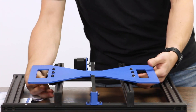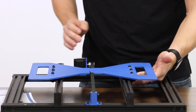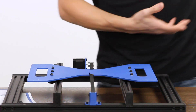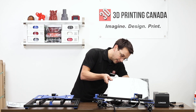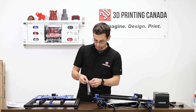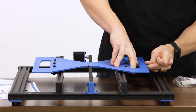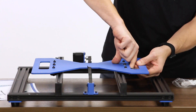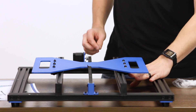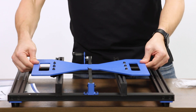So I'm just going to check the wheels on here. They're all contacting, so as I roll any one wheel the bed moves. This middle one has no tension, so I'm going to tighten that first. It's a good idea to do this before you've got this huge bed on here, because after that it makes it a little bit tricky to reach under there. Now with that tension, as I roll that wheel the bed moves. All of the wheels are touching and there's no play in this carriage at all.